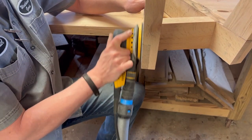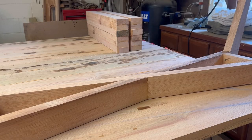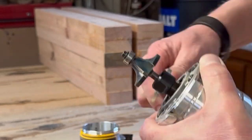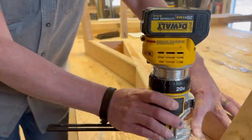Right now I'm not really doing final sanding — I'm just cleaning up the rough spots so I can use the router with a large round over and get this thing rounded over. I'm just getting everything out of the way so there are no bumps when I'm running that router around.